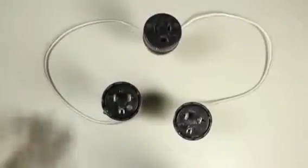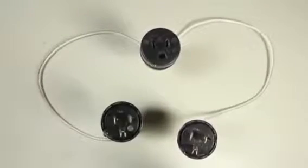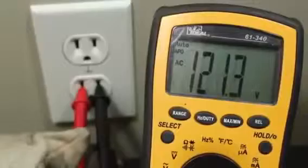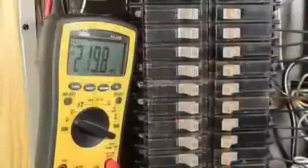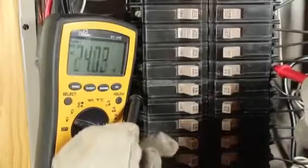I can't recommend this as the safest way to do it, but here's how I did it with a couple of plugs, a connector, and some 10-gauge wire. Each outlet in my house provides around 120 volts AC, and they're connected to a circuit breaker bus bar. There are 2 breaker buses, and if a hot lead is taken from each of the buses, we get 240 volts.